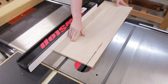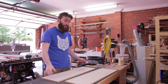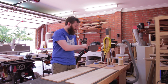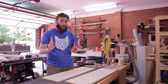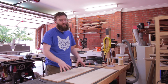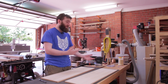Since it's such a thin veneer on these — maybe a millimetre at most — we need to be careful not to sand through and reveal the MDF underneath. Because they're already at probably the equivalent of 120 grit, I've got a 220 grit pad on my sander, turned down to 4th speed out of 6, and the dust extraction turned down as well, otherwise it'll really suck everything down. I've drawn on the surface with a pencil, going back and forth very lightly, so that I can see where I've been and where I need to go. I'm starting with the B side — if it isn't as good, that's going to be on the inside of the cabinet — so I can get a feel for how the veneer holds up under sandpaper pressure.